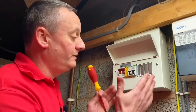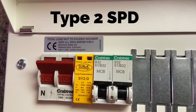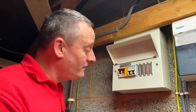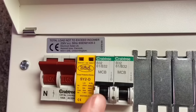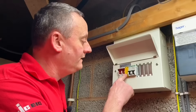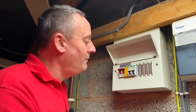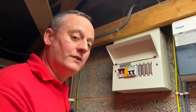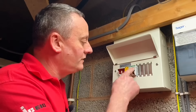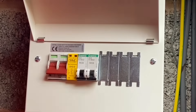The electrician made the engineering decision to install a new consumer unit, and after a conversation with the customer, they've also introduced surge protection. In domestic single-occupancy dwellings, surge protection isn't a requirement, but with a £40,000 electric car full of electronic components, an SPD is a good plan. We've got two breakers — one feeding the surge device and one feeding the EV charging point. The cable out is PVC twin and CPC clipped direct to the surface, so no RCD is required. Let's turn these off and look inside.